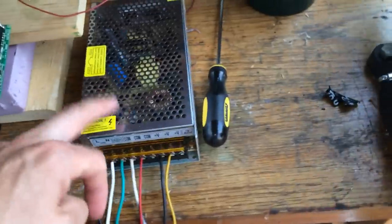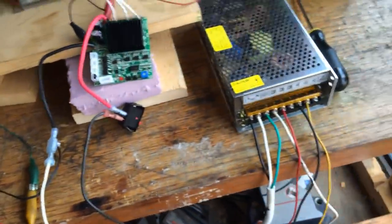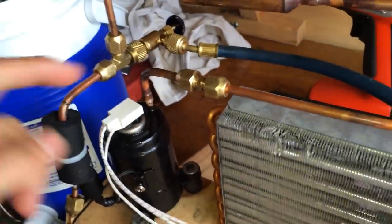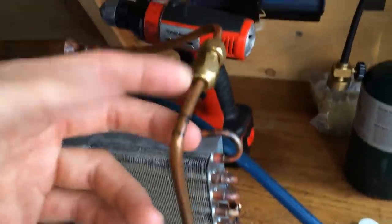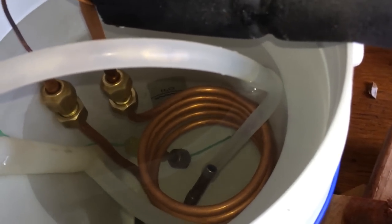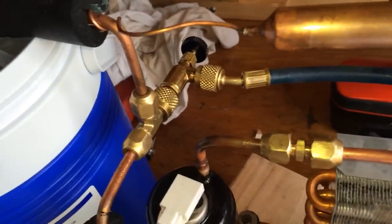I'm running propane in this little DC compressor. It's around 24 volts right now, off a couple of little power supplies just plugged into 110 volt AC. I think this thing's about 80 watts. All together right now, this whole system scratched together is probably drawing maybe 1.2 amps. As it's set up, the compressor discharges into my condenser, which has a 24 volt computer fan. Sub-cooled liquid comes out, goes through a little filter dryer, into a length of capillary tube which is wrapped around the suction line as a heat interchanger. So it descends down into a couple of loops of copper tubing and then comes right back up into the compressor.